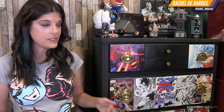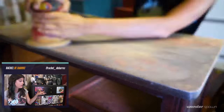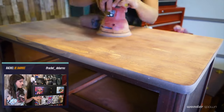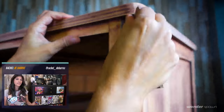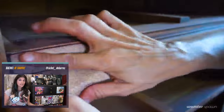So how did this all come about? Once I got the dresser home, the first thing I did was get all the original paint off — it was a beautiful cherry finish. First things first, I really debated about the handles because I love the gold color on them. I debated using wood putty to fill the holes and getting new handles, but at this stage I figured keep them for now. I hit the whole thing with the DA sander, and the objective is to go with the grain of the wood — especially important if you're going to stain the piece. If you're going to paint it, you don't have to get all of the original varnish off; you just want to scuff it up a bit.